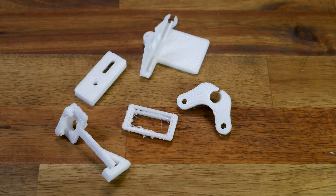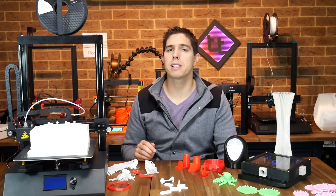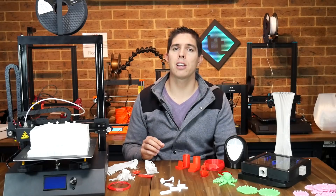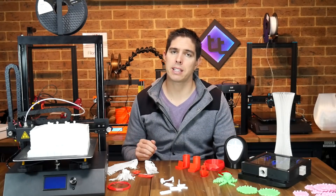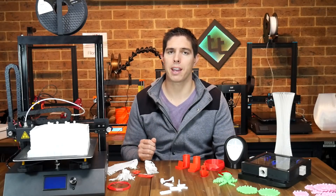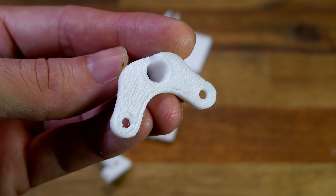Next I tried a range of small parts printed in PETG. Although they stuck to the bed fine, they suffered from excessive stringing. There's a fair chance that with the thermistor reinserted — and no bolt to hold it in an exact location — it's reading slightly low on temperature, causing the filament to ooze and explaining the stringing. After cleanup the prints look pretty reasonable, but not quite as good as the PLA prints done so far.